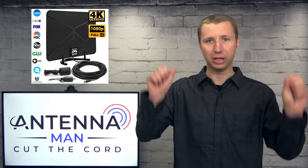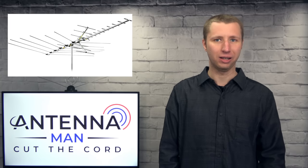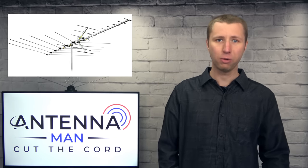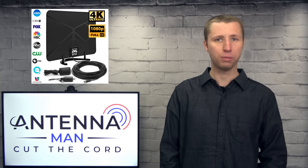The first thing I need to mention, and I'm sure most of my subscribers are tired of hearing me say, is that there's no such thing as an HD antenna. The whole HD and digital thing came from the digital transition of 2009. There was a lot of misinformation about TV signals, including the myth that you need a special antenna to pick up HD frequencies. The reality is that an antenna is an antenna — it doesn't matter if the signal is analog or digital. HD and digital are just keywords antenna companies use to improve online search results and confuse people into thinking they're getting something special.